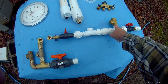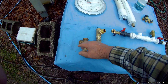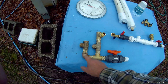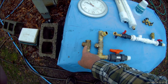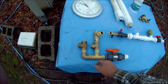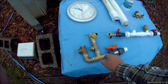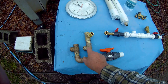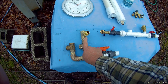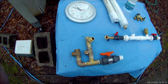The waste valve replicates the swing-door style you see in the middle of the linear pump. The arrow on the valve tells you which way the door swings when open — arrow pointing down means the flap hangs down when at rest. Next to it I have the identical check valve installed upside down, with the arrow pointing up, meaning when that door is open the flap goes up toward the top.